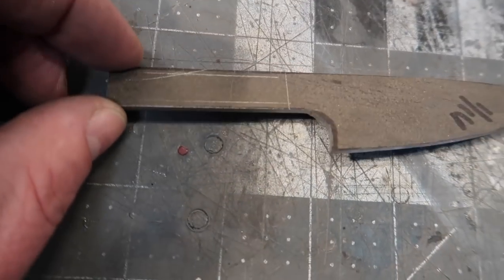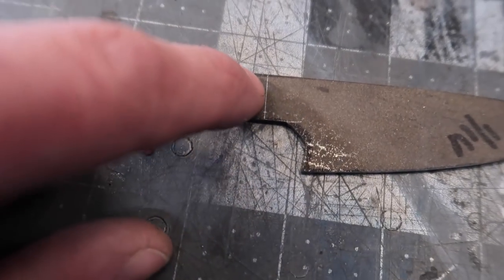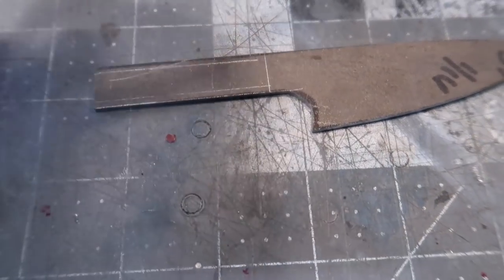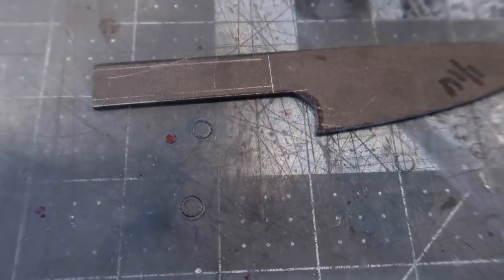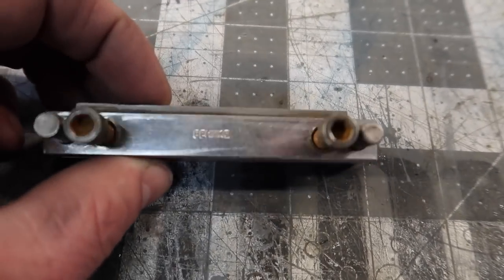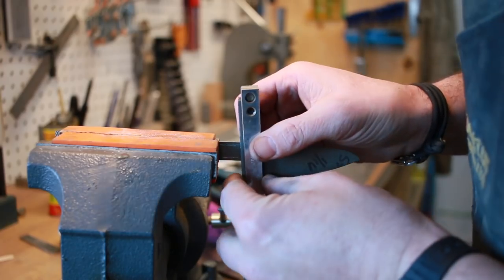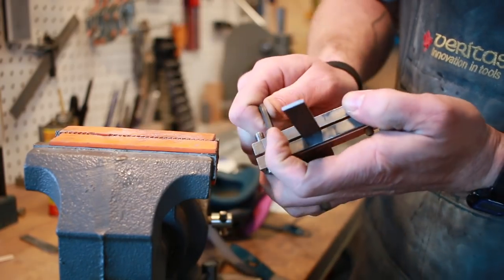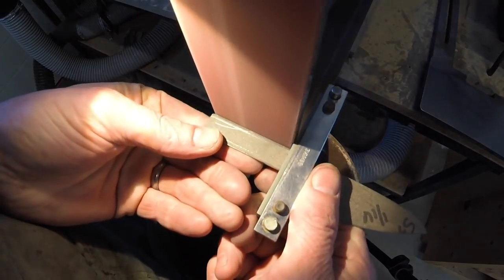This one is gonna be 3/8 of an inch, so I've marked that out. I just did some simple math there. Not gonna bore you with that stuff. But I've also marked where I want the shoulder to be. Not everybody does this step. Some people leave their tangs like this, but I actually like to have a step in my tang. I'm gonna put my Bill Banky file guide on here. I'll clamp it nice and straight, and then we'll grind this down and grind this down.